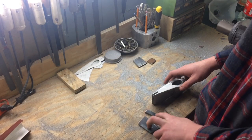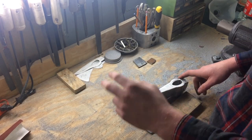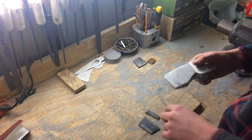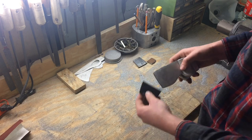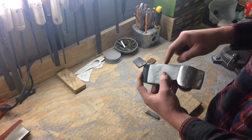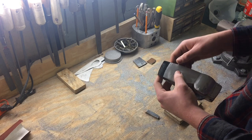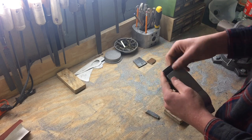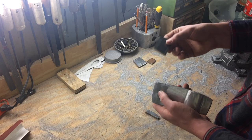I got the tip and the rear rough cut. What I'm going to do is glue these into the axe — just use some super glue so it's temporary — so that I can file and get the contour of the axe head. Then from there I'll hit it with a little heat to break the super glue bond, take these out, and go ahead and sharpen the tip.